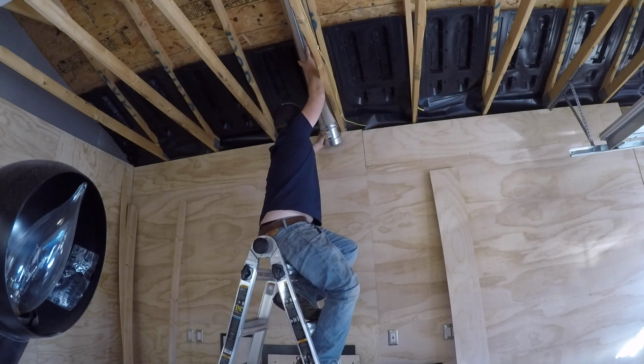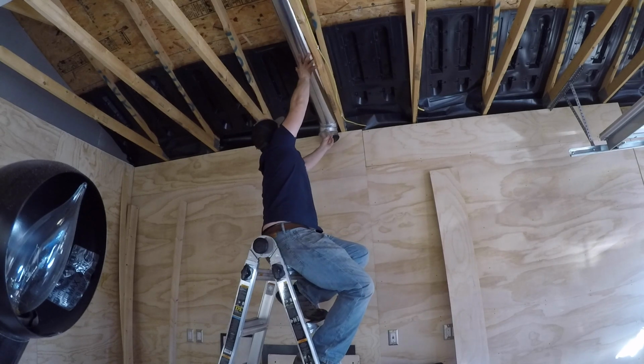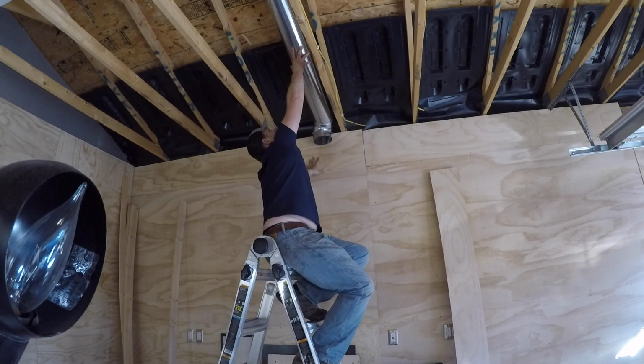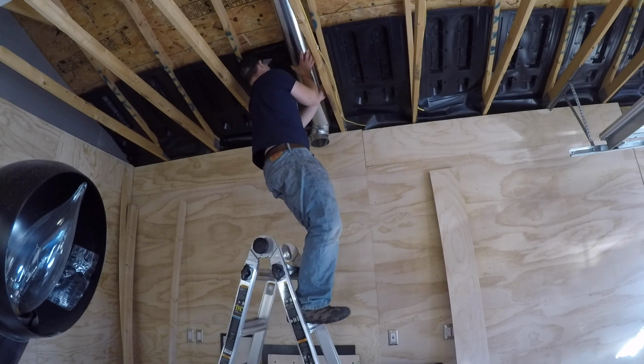If that old location is intended to have a large piece of equipment in its place as well, obviously the ductwork could get in its way. By having my ductwork exhaust through the roof, I can simply run a new line up to the attic from the new location and attach it to the existing ductwork with a little foil tape and some straps and have it vent out the same location in the roof.